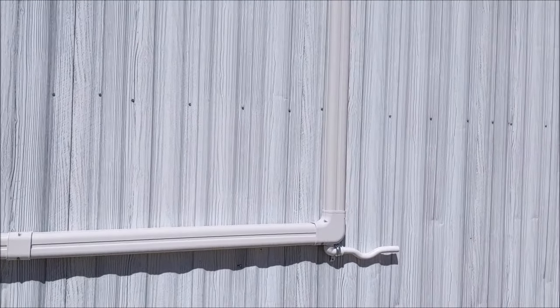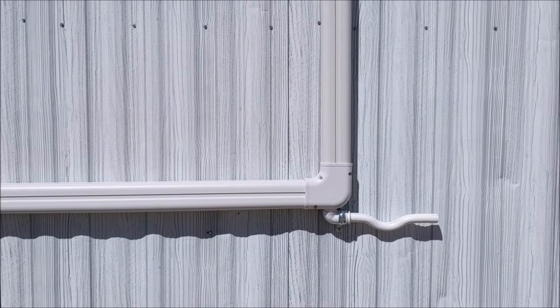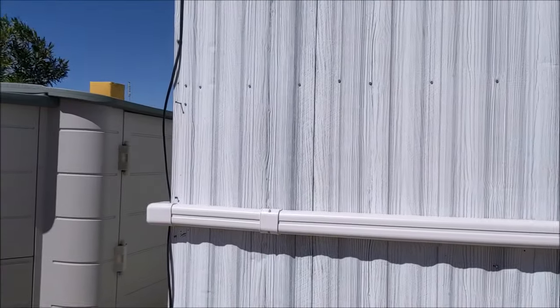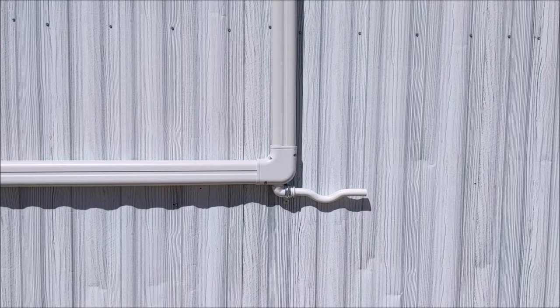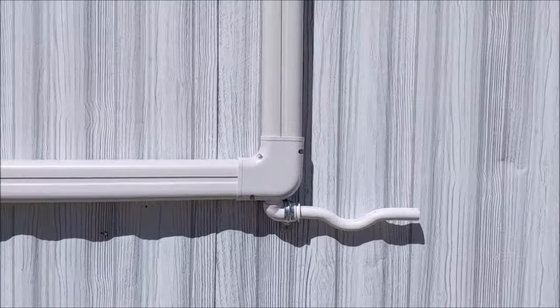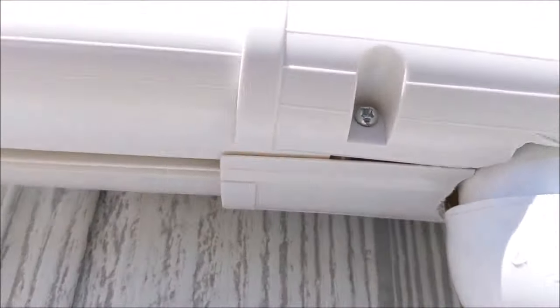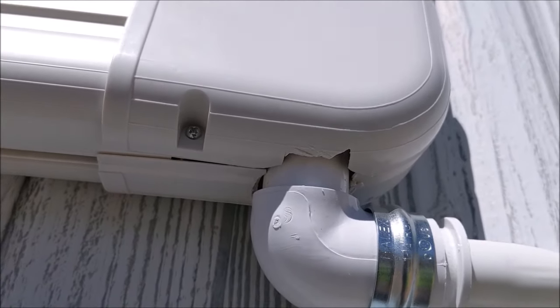Okay, so one thing we did is when we came down the covers, we just decided to bring our drain line there. There's no sense in trying to drain the water that way. Just have it come straight out. Put a little P-trap in there so you don't get the bugs in. And what we did is we opened a hole through the bottom there. See if you can see it there. And we'll just put some caulking over it in just a few minutes.